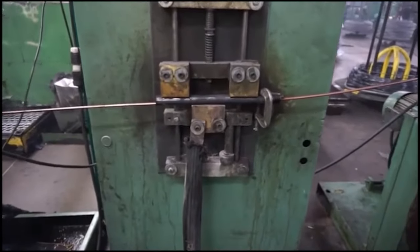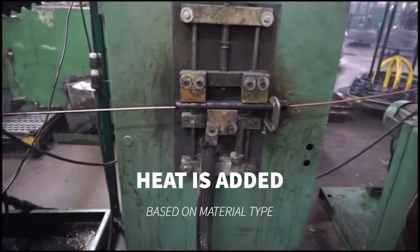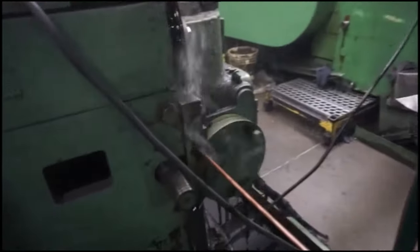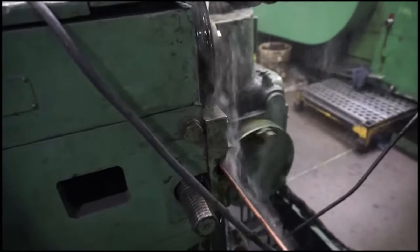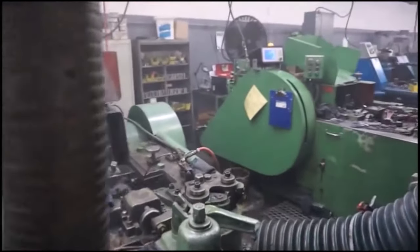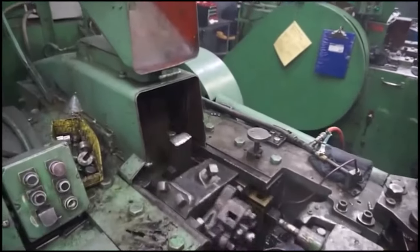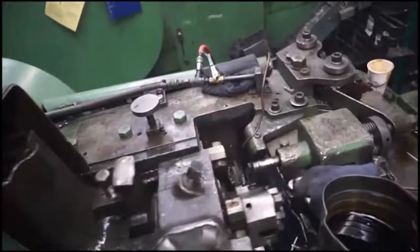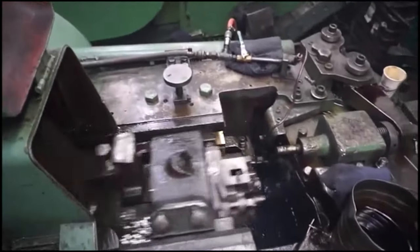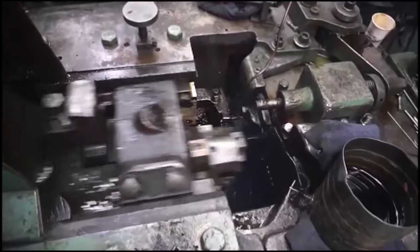In this case with copper-coated stainless steel, the wire is fed through a heating element which adds heat to the wire allowing for more malleability — though this isn't necessary for all material types. The feed rolls apply pressure to the wire drawing it into the cold forming part of the machine. The quill stabilizes the wire as it is fed in, while a cutter cuts a specific portion of the wire to be used to form the screw, done precisely in order to prevent any scrap.